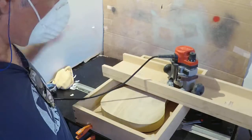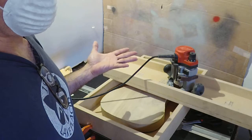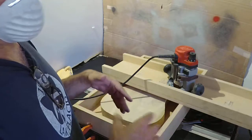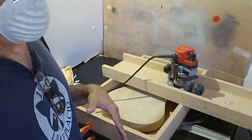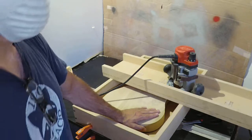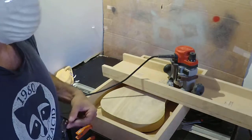Everything's very secure. We've got the router plugged in. The next thing is which way are you going to route? The bit turns in one direction. On smoother cuts like this, when you're taking off a 16th, it doesn't really matter too much whether you're doing what's called climb milling or not. Climb milling is basically when you're going in the same direction that the blade wants to go. It kind of powers it along, but has a tendency to get away from you. If you climb mill when routing out the entire body thickness at once, you're going to be in trouble — it's going to grab, throw, and it can be really dangerous. But in a situation like this, I'm just going to go back and forth and we won't have any problems. Being that it's such a light cut, I don't anticipate any tear out or issues like that.